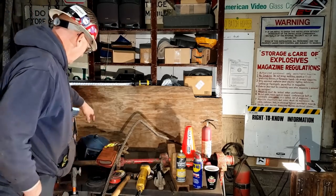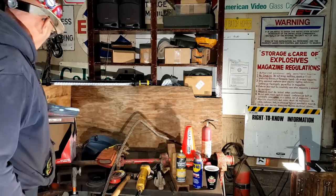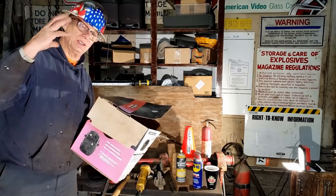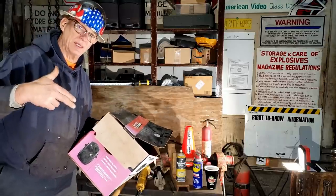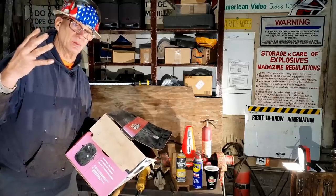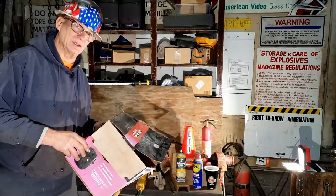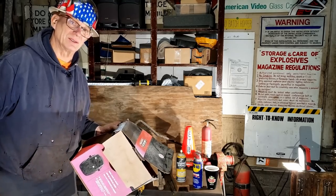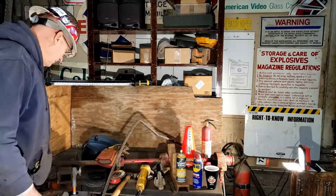We're going to use a Lincoln arc welding helmet. This is a single shade, a 10. It's not one that electronically changes. As you strike the arc, some helmets, not this helmet, darken the lens. That's really nice for high production work, maybe a little more difficult for maintenance work. For this, I just got a shade 10, solid, low maintenance, no battery. So that's the welding helmet we're going to be using.